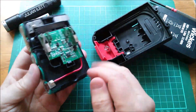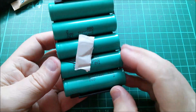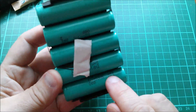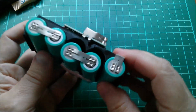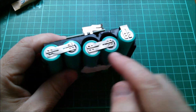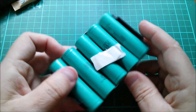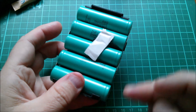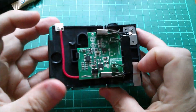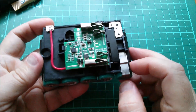And we're inside. There's not a lot in there. The cells are Samsung INR 18650-13Q - the '13' I guess is related to the 1.3 amp-hours. They're flopping about and not very well held in the cradle. What you can immediately see is that on the bridges between the cells there's just a strap with no connection up to the circuit board, so these cells are not being monitored on a cell level for over-voltage and under-voltage.